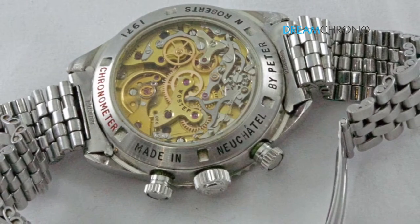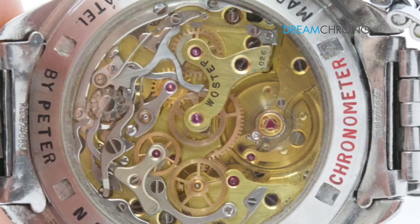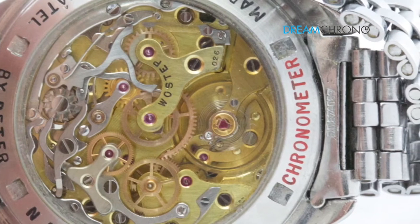The last part was obviously the springing and the making of the balance spring, because you did everything. The balance springs were Nivarox 1, just a spiral — a box full of balance springs all tangled up together. The professor, once you built a spring — which meant you selected it, calculated what they call the CGS number, centimeter-gram-seconds, which is the strength of the spring — you had to calculate that for the particular balance of the watch, then make the spring: collet it, cut the centre out, pin it into the collet, pin it to the stud, then form the overcoil. Once all that was done and he was happy with it — running flat, concentric, round — he would destroy it, pull it out and say, go and do it again. And you'd make another one, and another one. This went on for months, and after some months you were very good at balance springs.